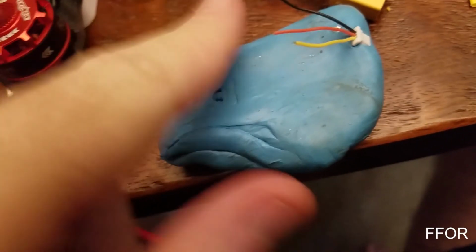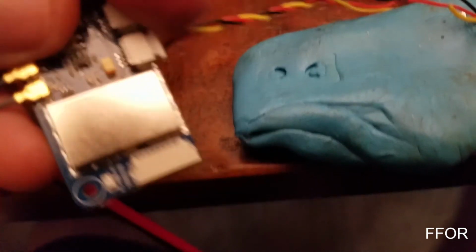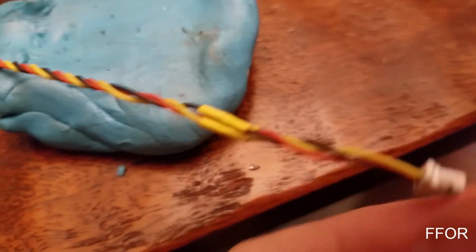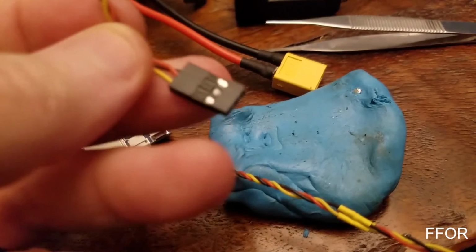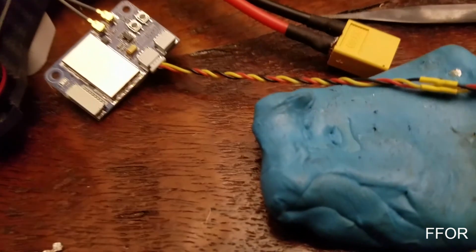So now I'm going to be wiring in this AX6B, and it comes with two of these types of cables with the three wires, and so I'm salvaging one to make one full length cable that has the same type of terminals. All of the others come with servos, and I'm not 100% sure why, but you basically just resolder and make it so it can plug in into the flight controller. So here's my new connector. Got it all wired up. I don't know why they didn't send one like this, because I don't think anyone uses pins or servos as much anymore. And this is the fairly new one, so. But got it in, and I'm going to bind it and see if it works.